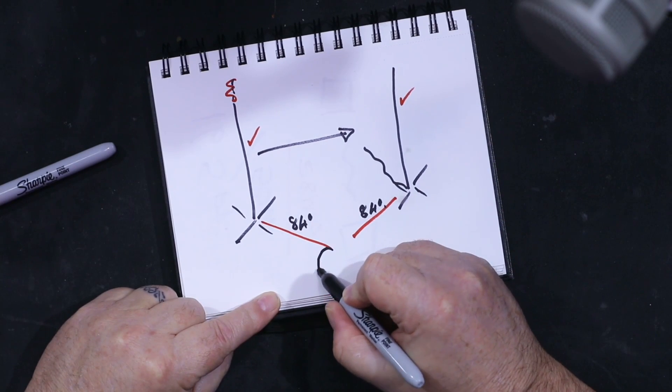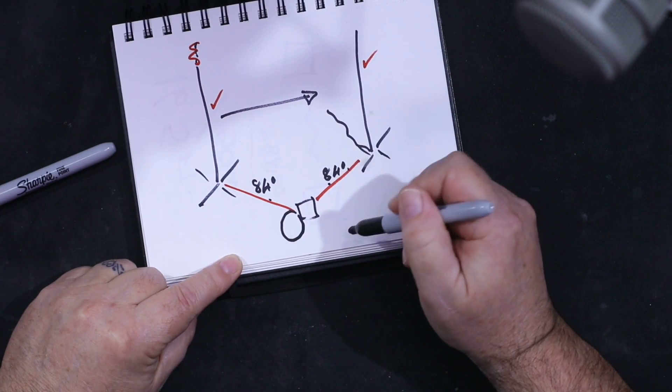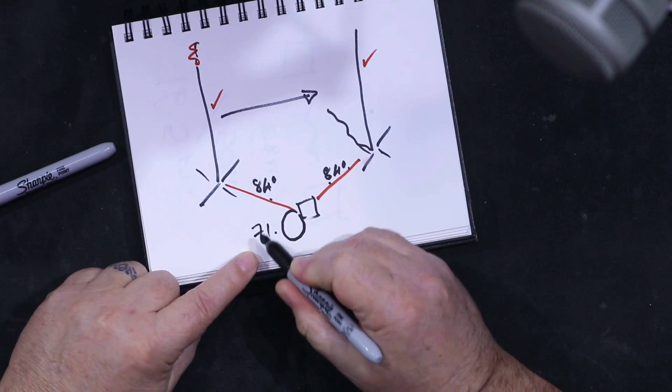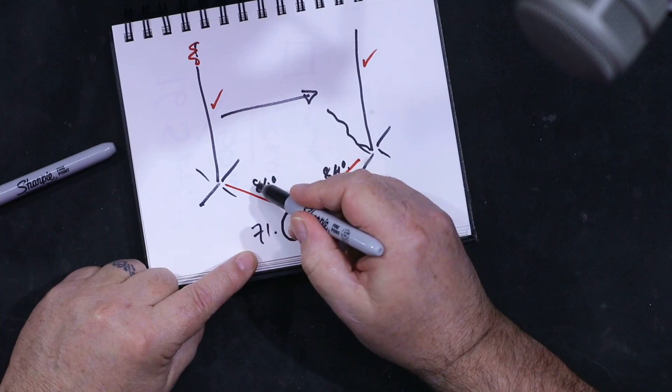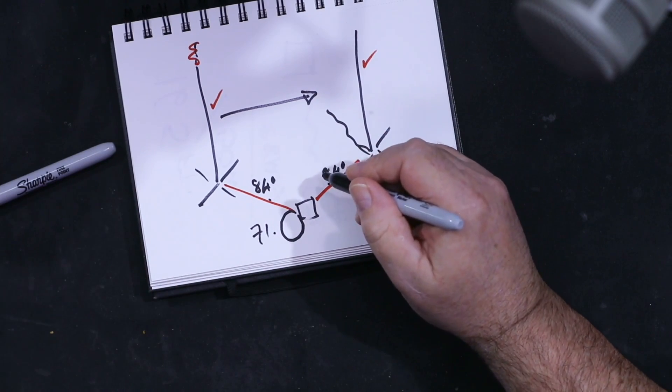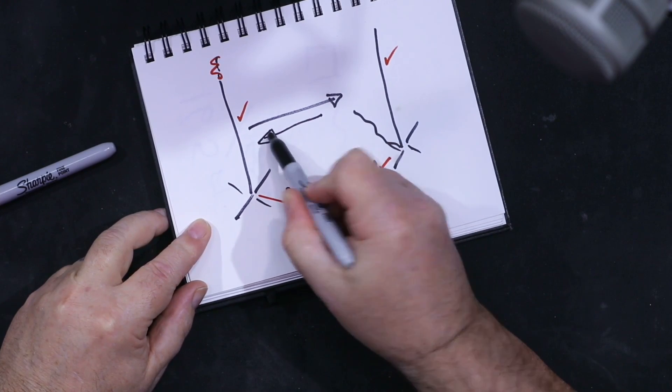It's a bit odd saying 84 degrees long, but they are. And then we've got a very accurate 71-degree delay line which we bolt into our box. That could be switched either onto one element or the other. So 71 plus 84 gives 155 degrees — and that's where the voltage sweet spot is. The delay line means the signal goes toward the delayed element, so your delayed element becomes your front element.